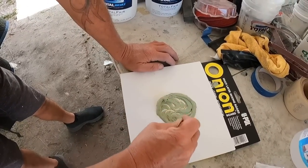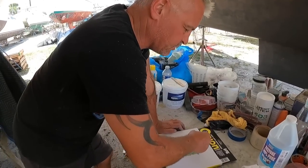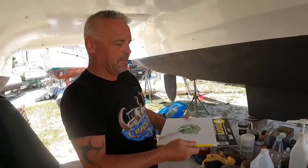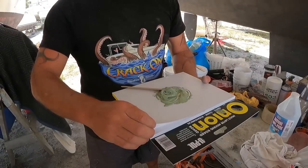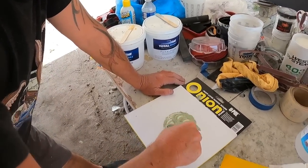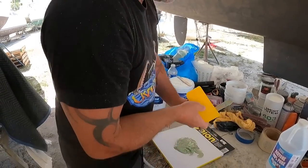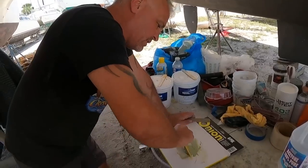I've also found a little local fibreglass store up the road — I'll find out the name for you because they're really, really good and they do lots of deliveries. They also do this product: a fairing board. It's nice and stiff and you mix on it, then use your spatulas to work with it. When you're done, you peel off one sheet and you're back to a clean board — I think that's ingenious. Normally I'd use a piece of cardboard, but cardboard is porous and you don't want to mix on something porous, because the chemicals in the curing process could be absorbed into the cardboard instead of staying in the product.